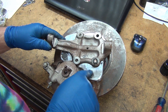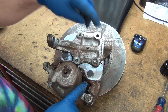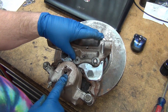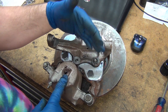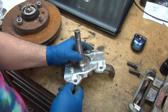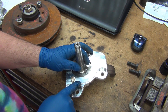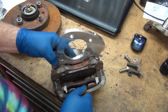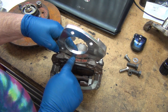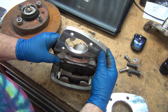Same down here when the steering arm comes through — I want to remember there might be some clearance issues there. I've already moved that in CAD slightly and created a pocket up under here in CAD to deal with the spindle clearance. I need to send it to the guy who ordered the kit and have him test fit all this against his, because he has a steering arm and everything. Center hole clears. What I did here in order to clear the caliper bracket — I just roughly clearanced that out with the manual mill — is because these pads move down, which brought the face up closer. These are the disc brake ones — tons of room, didn't have to worry about it.